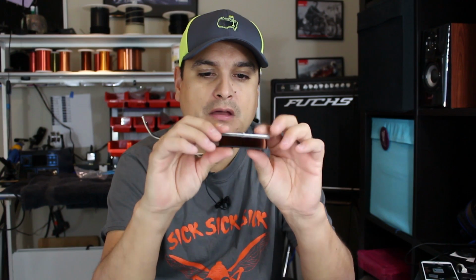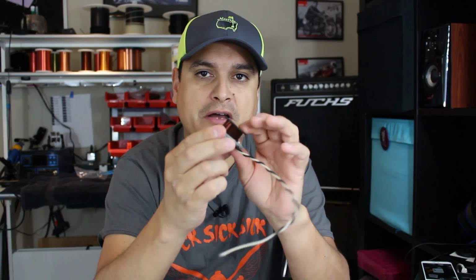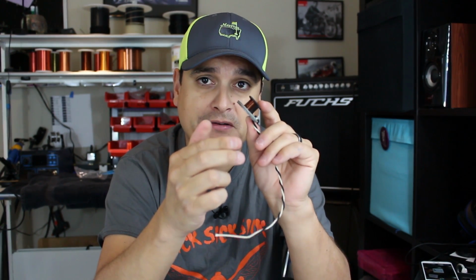And we know that the coil has more freedom to move around, and you can hear that in the tone if it moves towards feedback more easily. And on the secondary side, when we start introducing other frequencies, it can do some very cool things. That's one of the reasons why we don't pot this pickup. We dampen it with wax underneath here, and then we don't pot the coil, and this pickup sounds different than one that's fully potted.